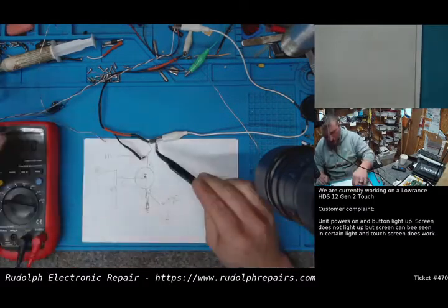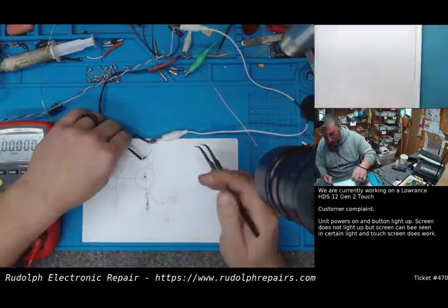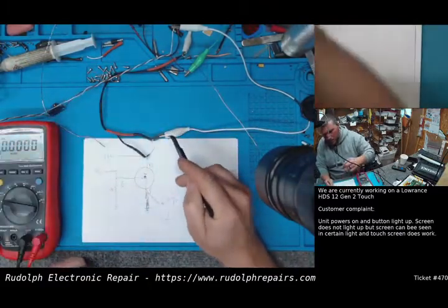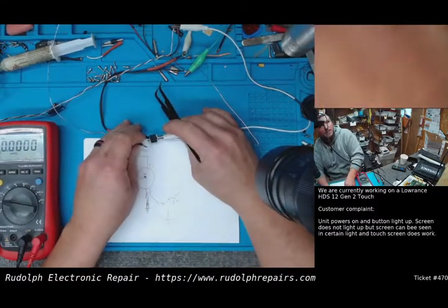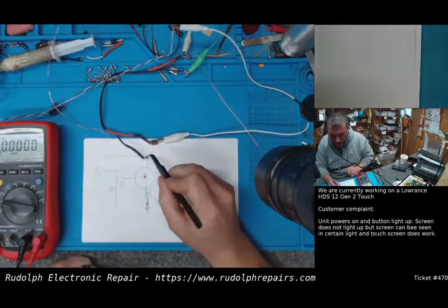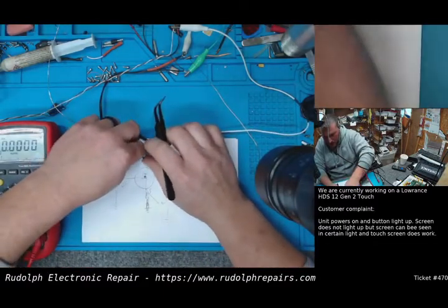We set it up real quick. Here's our MOSFET. Okay, so drain, source, gate. That's how this is. Left pin is drain, which is our plus 12. Middle, which is this large contact on the MOSFET, if you can see that, is source, and gate is the last pin to the right. So we have the gate going to this 1K resistor. And now let's test this real quick.